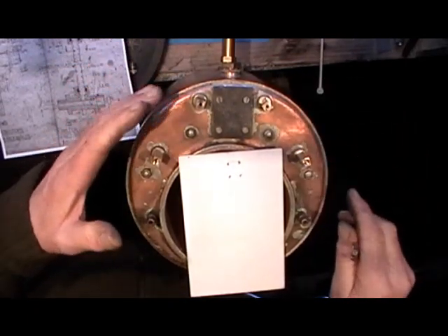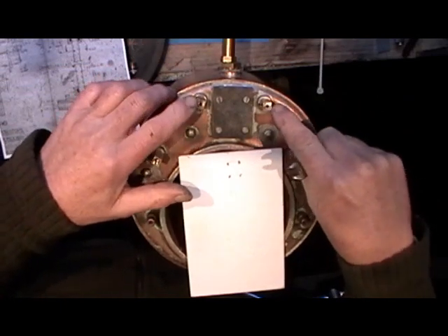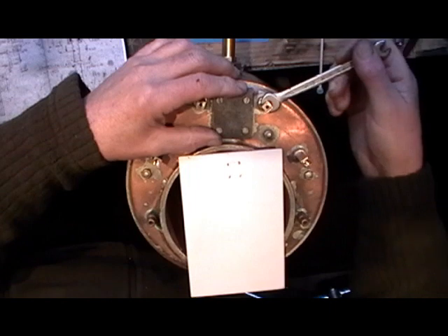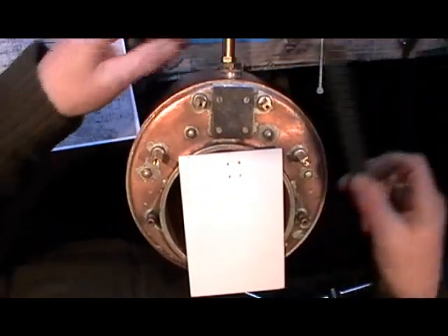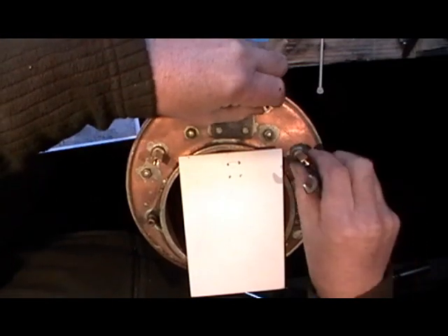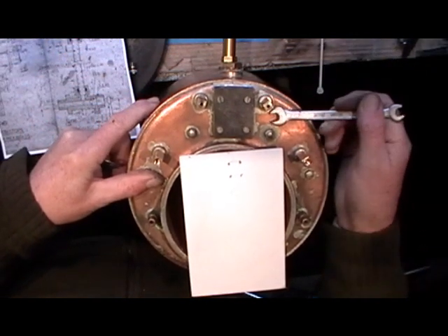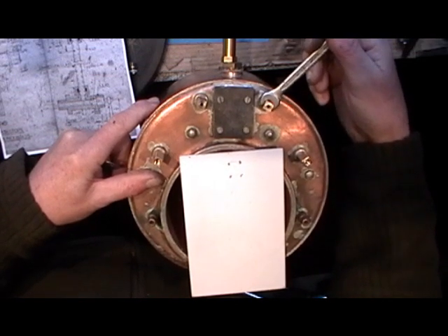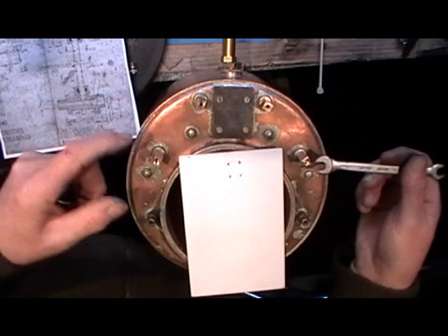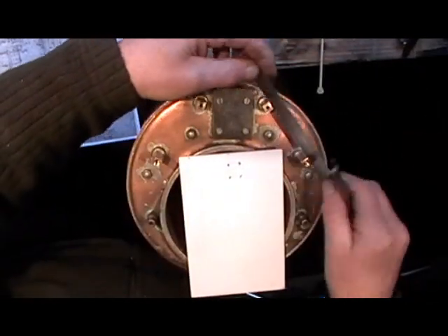This is how I'm going about getting everything in line so it lines up for the glass. I've screwed my fittings up to the stage where I have the four flats on the square profile up to the face of the housing. I want the flats of the fittings on one side to be exactly in line with the other flat at the bottom. So for example, if my fitting when fully tightened up to the housing on the boiler ended up slightly off, I take it out, set it up in the lathe, and skim a couple of thou off each time until the fitting is dead in line with the other fitting at the bottom when tight.